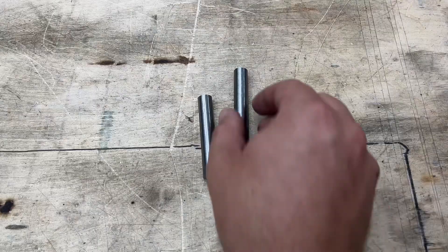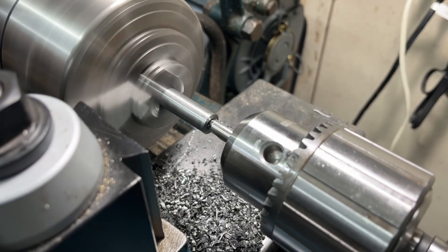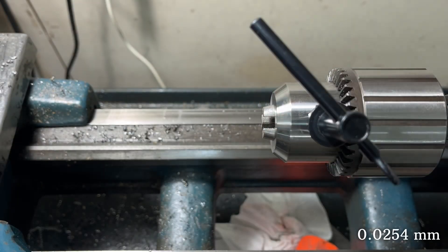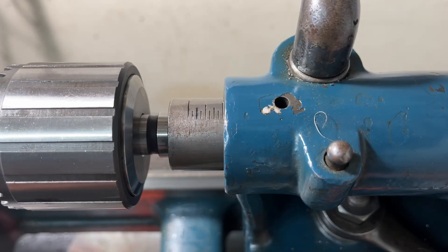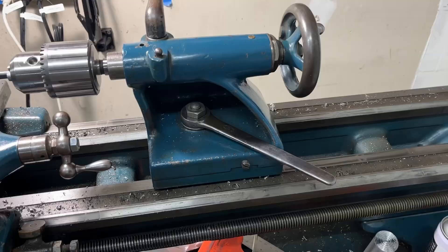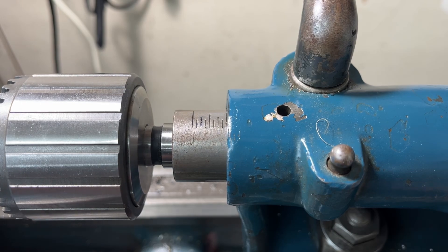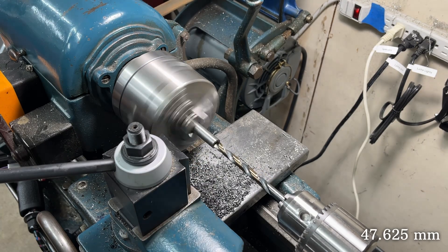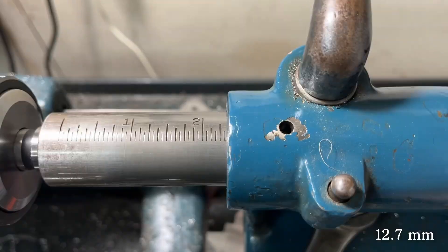Removing the scrap steel, I grab the first piece of raw iron and mount it in the lathe. I will first be drilling a hole in the iron, starting out with my trusty center drill. I drill a new center hole and clear out most of the material with a quarter inch drill. When drilling the hole to the final size I want the depth to be relatively precise — within 10 to 20 thou is plenty good enough. To achieve this accuracy I first set the tailstock to read 3 eighths of an inch sticking out, then pinch a large parallel between the tip of the drill and the face of the material before locking my tailstock in place. When I remove the parallel I can advance my tailstock so it reads half an inch, which means the tip of my drill should be right at the face of the iron. Adding some cutting oil, I finish drilling that hole to 1.875 inches deep. Since most of the material is removed already this hole goes pretty quickly. The only tricky bit is to remember to add half an inch to the measurement when reading off the tailstock.